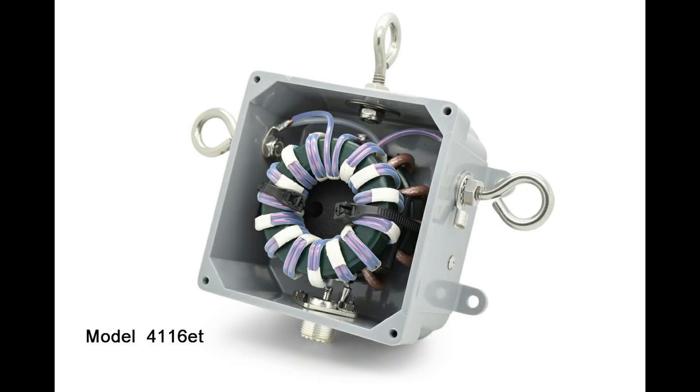I was reading about it and I'm going to read this to you. It says it not only has a 4 to 1 voltage balun, but it also has a 1 to 1 current balun. If you look at the image, you will see a coaxial wound 1 to 1 balun underneath, and the 4 to 1 voltage balun stacked above it. The combination results in a very versatile, rugged, and forgiving 4 to 1 current balun. By utilizing a voltage balun at the first stage, the unit is able to handle most compromised installations, with the 1 to 1 current balun providing superior RF choking.